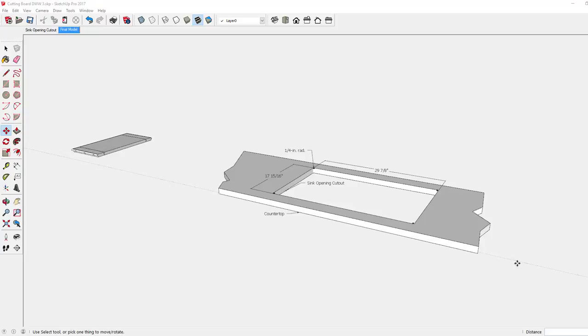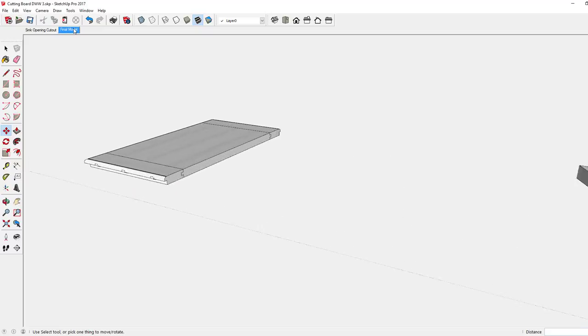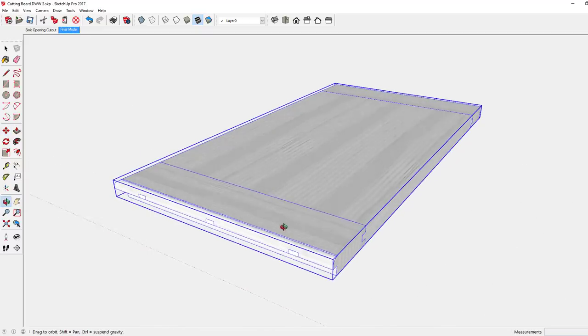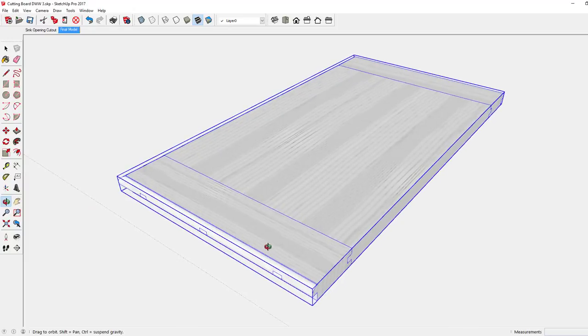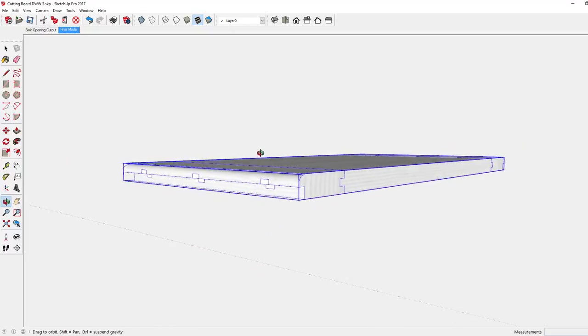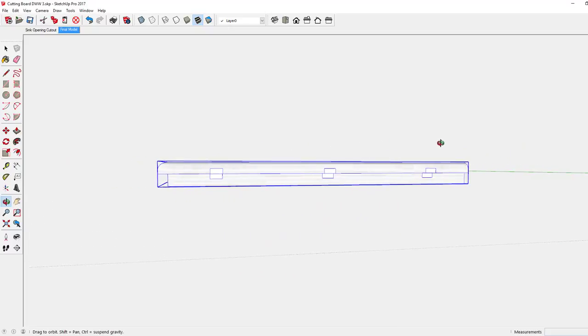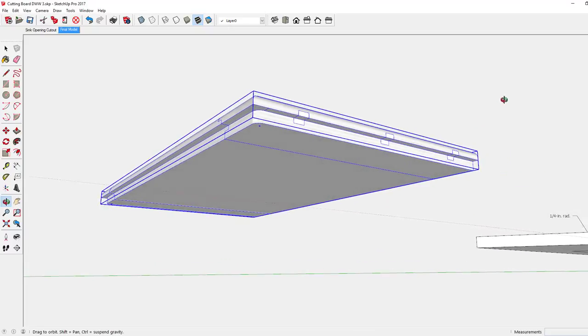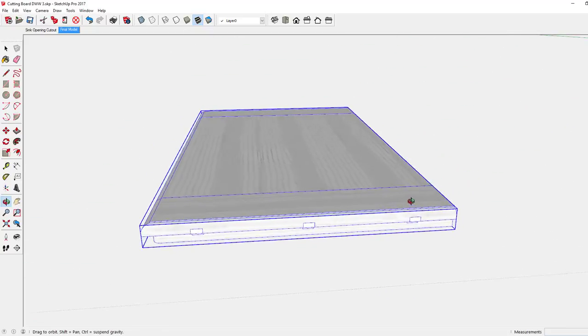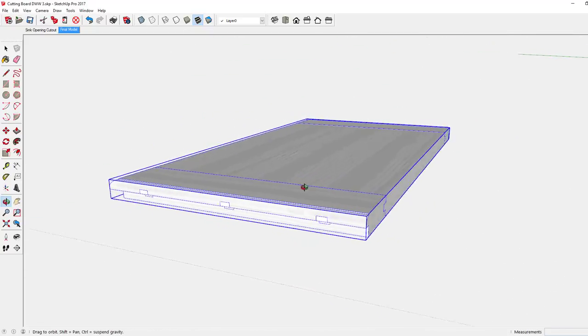This time of year means handmade gifts, and this one is extremely useful and practical. A cutting board for an undermount kitchen sink. It's sturdy and held into place by the rabbeted and flanged edges of the board. It is also sophisticated with breadboard features that accommodate wood movement. I used maple for its hardness and closed grain.